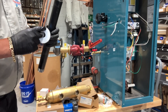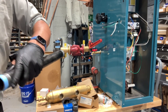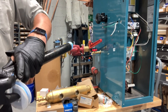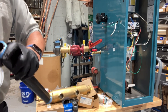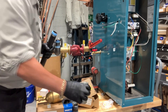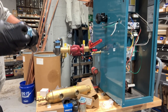I'm going to be using the Blue Monster PTFE tape on my threads — five or six wraps is more than enough, and I like to go a little extra on it. I'm also going to use some pipe dope — the Mega Lock — just a thin coating. It's like double glove protection.